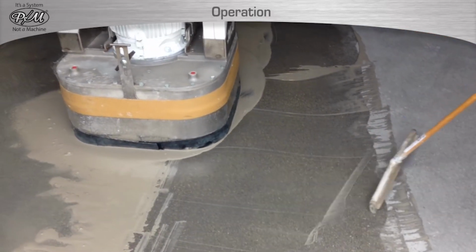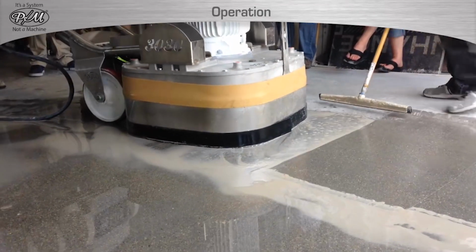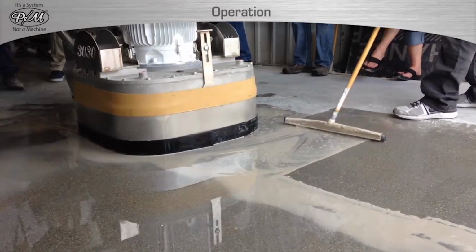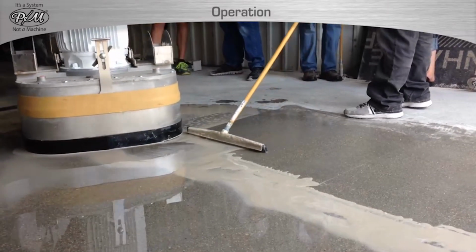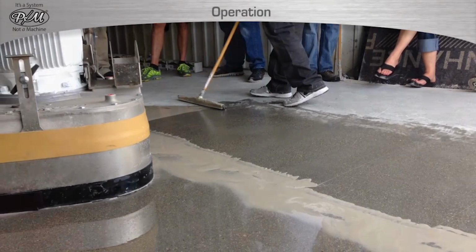By doing it this way, the water being consumed will be less than if only used for one pass. You will also notice that the slurry is only being pushed over approximately 80% of the cut path. By doing this, the helper is showing the operator exactly where the machine needs to be for its next parallel pass. About the slurry's reuse.